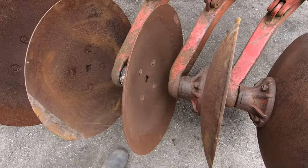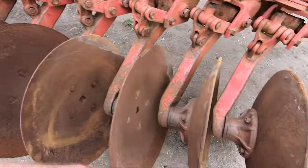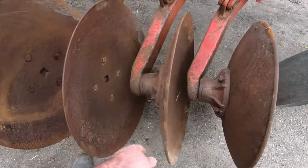So this is the one I replaced, and then this is the one that I was going to replace, which isn't as bad as I thought. This one was actually worse. It had some bale strings stuck in the hub. So now I'm hesitant to actually do it, because we don't have the correct hub seals, and you can't buy them. Obviously this is International Harvester and they don't exist anymore, and Case sure as hell isn't going to pick up the slack for the parts for them. So you can't buy those hub seals, and there's not even one that's readily available. The ones we do have are slightly too small and they spin in the hub, and it's probably going to be worse changing them, putting those hub seals in, than just leaving the old ones on there.